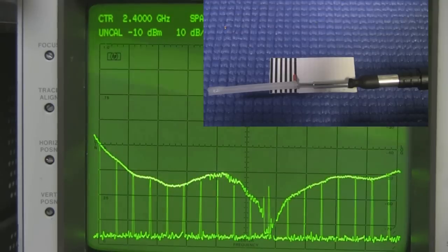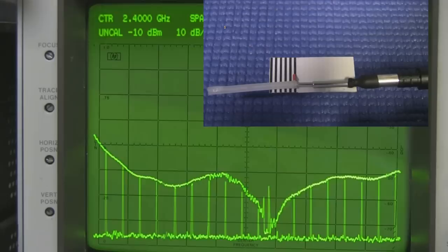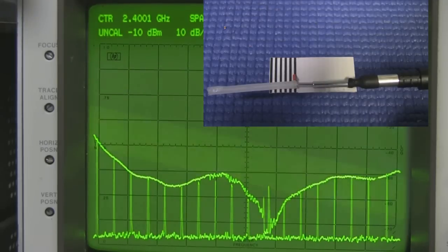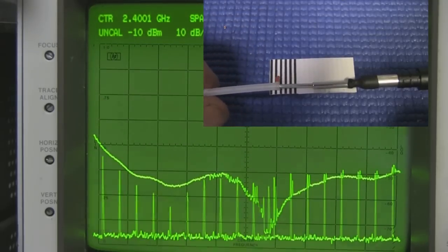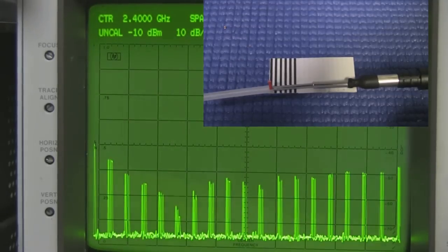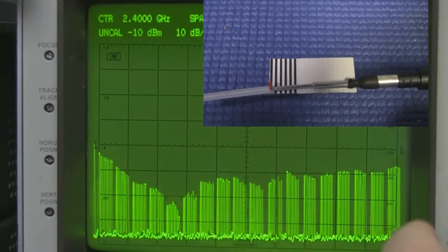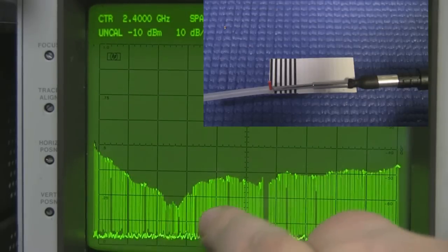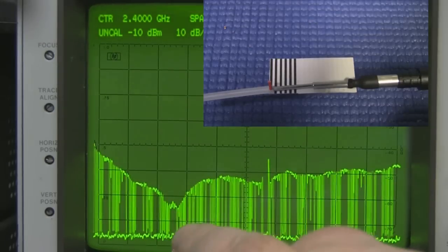At the moment with the dipole at 25 millimeters, the response on the spectrum analyzer is perfect for 2.4 GHz. Watch what happens when I extend this driven element out to 31 millimeters. I've drawn it out to 31 millimeters — refreshing the screen — you can see this is 2.4 GHz, and sweeping from 1 GHz to 3 GHz, the response has shifted way back to about 1.5 GHz.